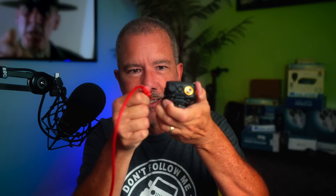You will need a cable that plugs into the side of the radio. You can get these cables on Amazon for $8 or $9, but I've seen more complaints about those cheap cables not working than anything else. Half of the cheap ones I bought didn't work. I learned the hard way to use the better $14 cable — this is an Ocean cable from buy2wayradios.com, affiliate link below. It's only a couple of dollars more, always works, no driver installation needed, works with Windows or Mac, and you can call a human being in the US if there's a problem.